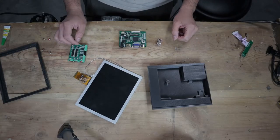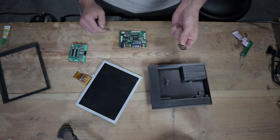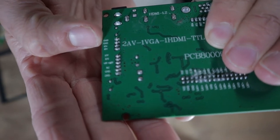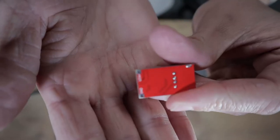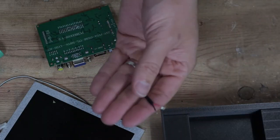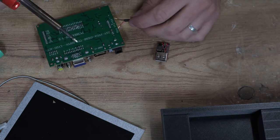Basically what it comes down to now is just assembling everything — getting all of the plugs plugged in, everything soldered together, getting the power situation figured out, and then screwing it all into the case and closing it up. The first thing I want to do is get this step-up converter wired into this 12-volt auxiliary. On this board we have a 12-volt and a ground — that's our positive and negative. We have the same pins on this board, so I'm just going to solder those directly. I've got a little jumper wire here with the leads tinned already, so we're just going to solder onto the ends here.